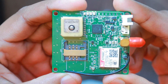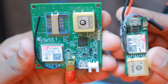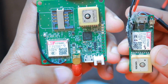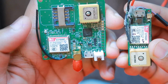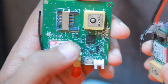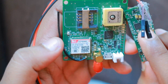So this is how the board looks. It is the same Wildtrak V2 GPS tracker with most of the things removed. The only changes are that the SIM card connector used is for a bigger SIM card, the antenna has been changed to an SMA connector, and we also provided the option to connect a small wire antenna which is very inexpensive and will keep the cost low. One more minor change was that the microcontroller used was changed to a different version compared to the Wildtrak V2.